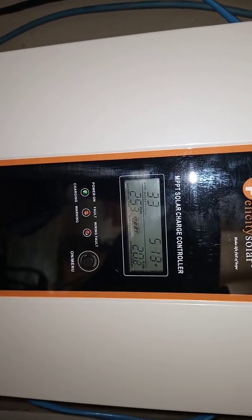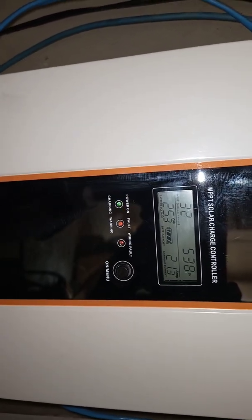Right now I'm on 533 watts and I'm charging the battery with approximately 16 to 20 amps. This looks very great. If I'm able to pull about 530 — and this is 21 amps now — that's about 550 watts from a 900-watt panel.